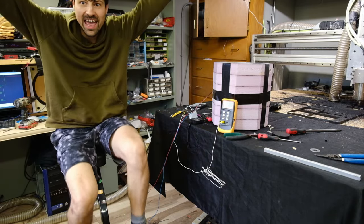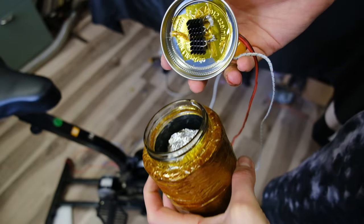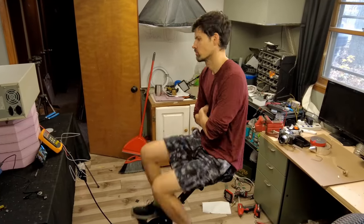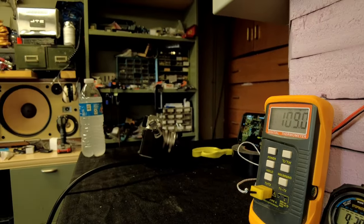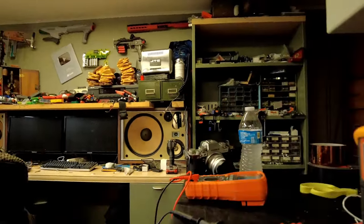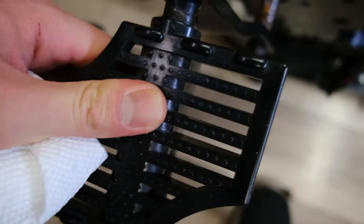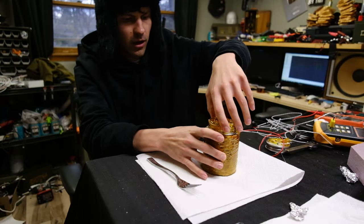The tiny potato chamber heated up quickly, so I decided to return the oven to its original chamber size — I was going to go big. The larger potato takes much longer to cook. I was disappointed to find a half-cooked potato after 45 minutes of pedaling and reaching 250 degrees Fahrenheit. My next test took forever to heat up as I realized the heating coil was short-circuiting. So I built a new coil, but during that test I realized the pedal was having issues — I'm pretty sure it was cross-threaded. After fixing the bike and pedaling 75 minutes, reaching 275 degrees Fahrenheit, and a total of over three hours of pedaling that day, I opened what I hoped would be a fully cooked potato.